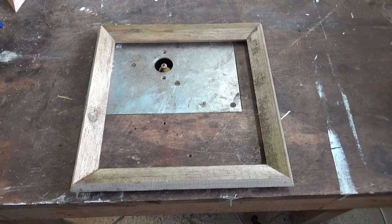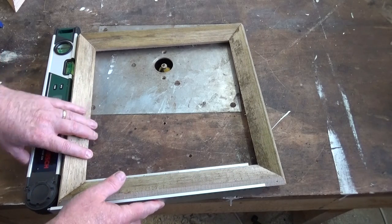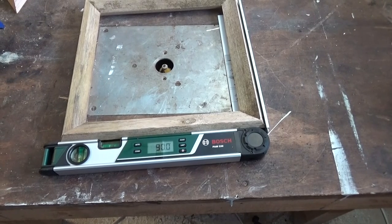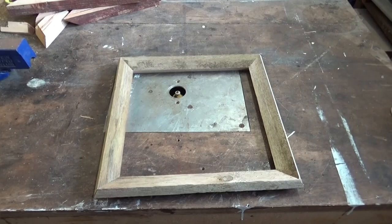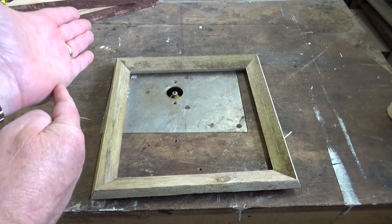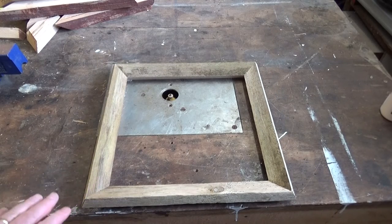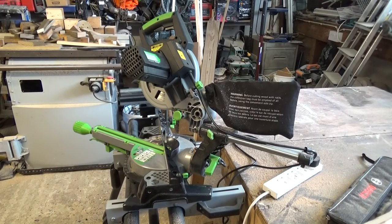So let's see what we've got on the angle. This is going to be quite difficult to do because — I don't believe it. Look at that. Would you believe that? It doesn't come any better than that — 90 degrees. And like I said, that's all down to saw accuracy and setting your saw and tuning it. To actually make that frame took me about half an hour. The most difficult thing was to cut these pieces the right length, because you can't put one on top of the other — you'll end up with one piece shorter because you're cutting down at an angle. I just like the way they look. They draw you in. So if you made that into a picture frame it will draw you into the picture.